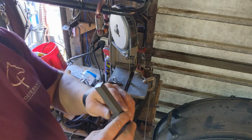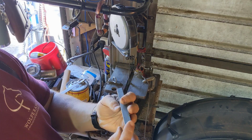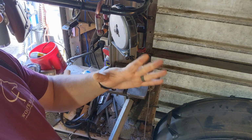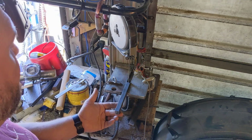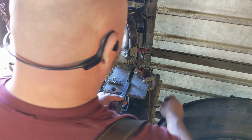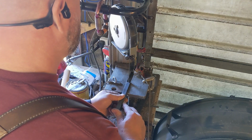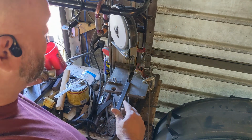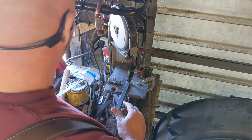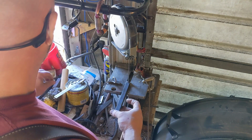All right, so I take my blank. This is 6 7/8 inches long, and hopefully the ends are nice and clean. Sometimes, if it has a little burr on there, you get hung up. Feed it in there. I'll do the full length cut here first. So I'll go ahead and start it for a second. I'm getting it started. I'm putting a little bit of beeswax on there.